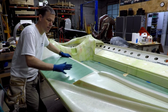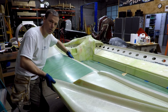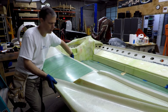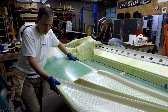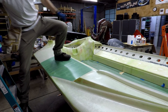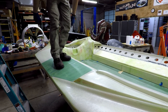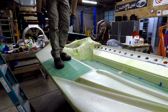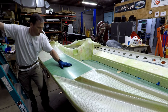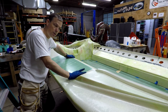So here, keeping in mind that where this will have rivets, the rivets are just there to put clamping force on the part while the adhesive cures. The adhesive is actually what gives us the strength, and this is not glued at all right now — it's only just temporarily attached. But that said, I'll stand on this to show how stiff it is. There is no movement at all. You would think this kind of strength comes from all that weight — this side is 13 pounds. Very, very lightweight.